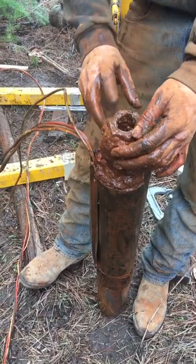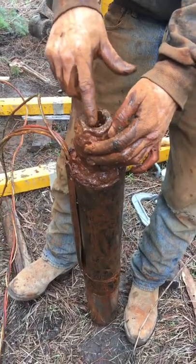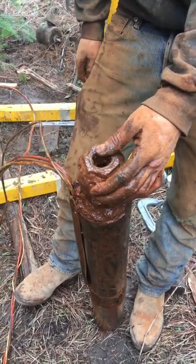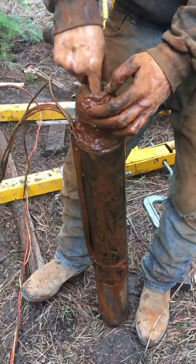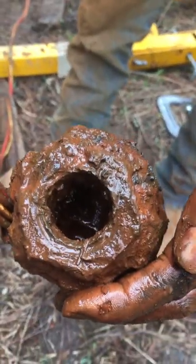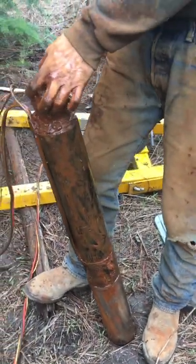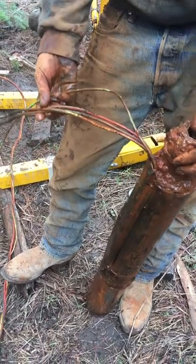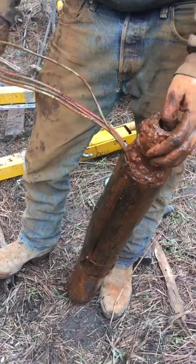I'm thinking that when these pumps start, there's a lot of twist force on it. With a weak pipe, it cracked around here — it wasn't completely broken off, but about half of it was broke, just barely hanging on there. Good pump or bad pump, I have no clue. It's literally clogged full of crap up in here — stuff's been getting in there for quite some time. Either way, after all this work, I don't think I'd even consider putting a used pump back down. I'm just trying to talk myself into reusing the wire as it is.